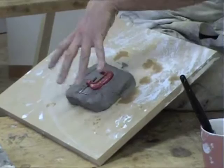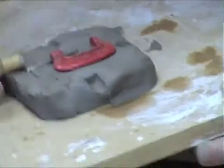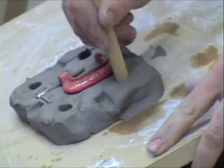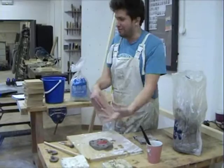When you stick the two halves together, you want them to fit together exactly as they should. You literally just key in some holes. I normally do it one way, but another method is to key them in a different direction as well. As long as you have what are called keys, those are what join the two moulds together.